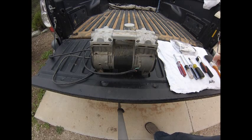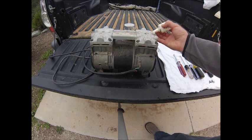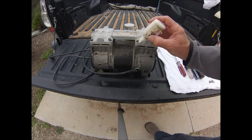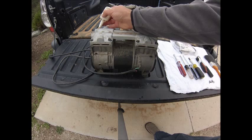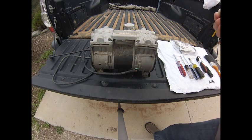As you can see, this showed up fairly dirty, so we're going to want to clean it up a bit. But first things first, these head screws can tend to be a little bit tight, so we like to put a little bit of solvent — I just got WD-40 in an eyedropper here. Go ahead and lubricate those up a bit and let that settle in.